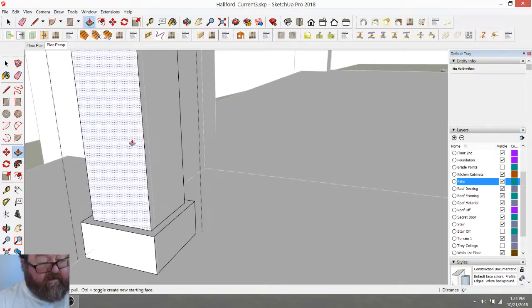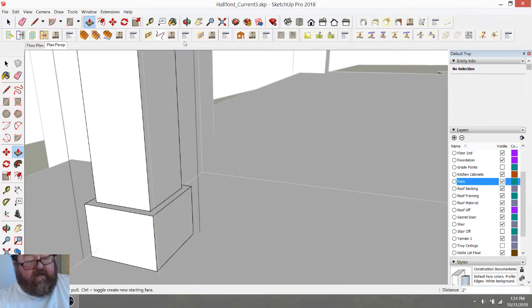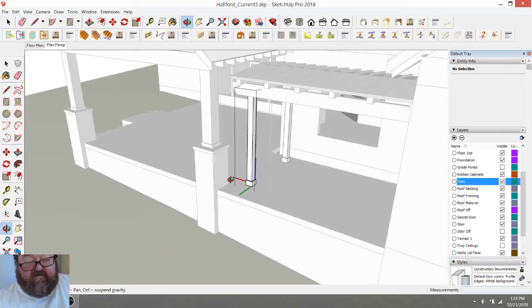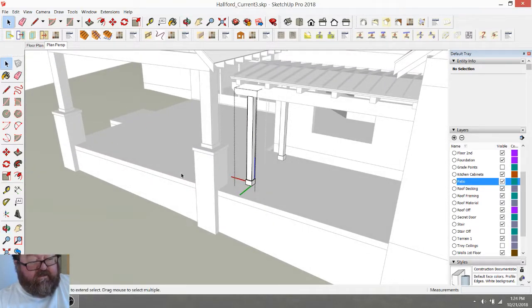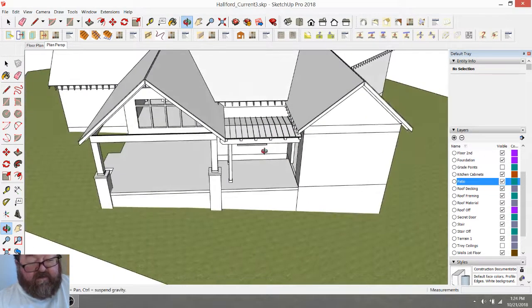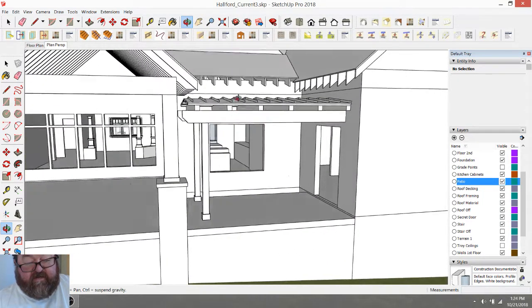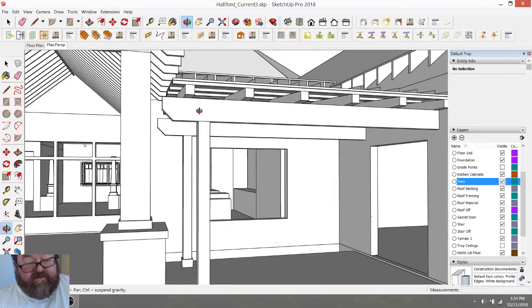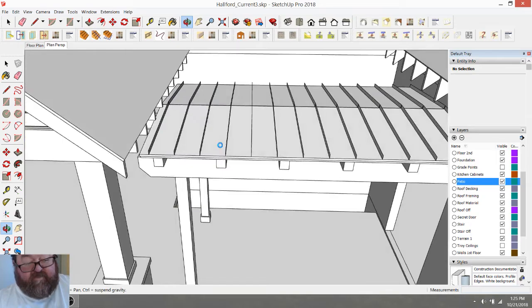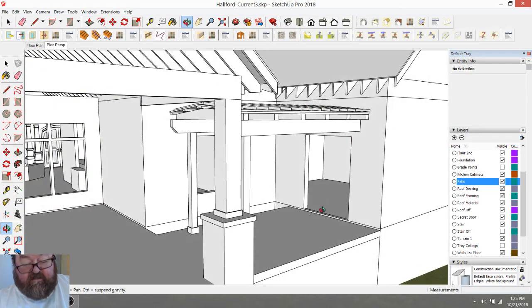And you could even make it taller. You could make it, you know, more crafty if you wanted to. Like it's a 1x6 instead of a 1x4, which I think looks better that way. And that would all be out of Western red cedar, you know, something really attractive, like the 2x4s and everything. And then you'd have your standing seam roof on top of that, and the water will just shed off both sides, hit this slab.